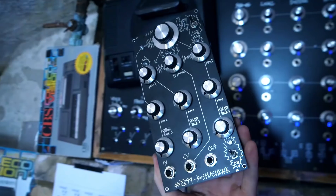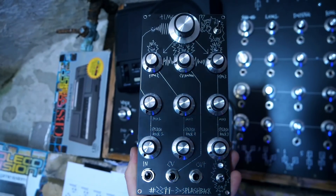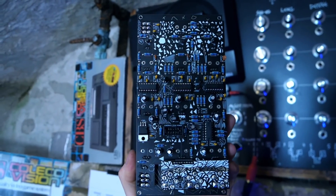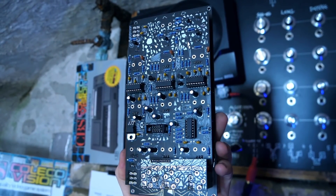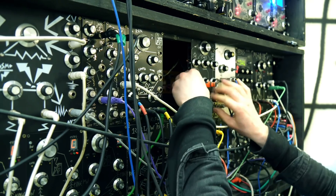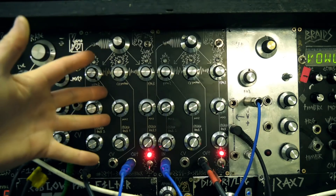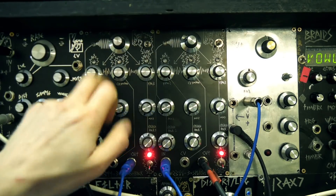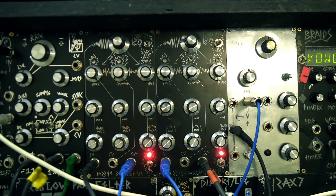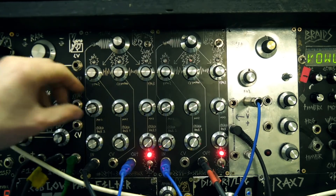Then put on the knobs — any knobs you want work, but links to the ones I use are in the description. Admire your workmanship — hopefully it works, fingers crossed. Check the back and make sure all the solder is done nicely; reflow it if anything doesn't work. I somehow lost the sound to the next bit, but let's go — I've got two plugged in but I'll start with one. Let me bring in a synthesizer line going straight into it and bring in the first delay.